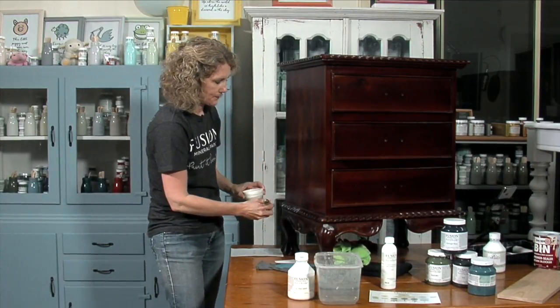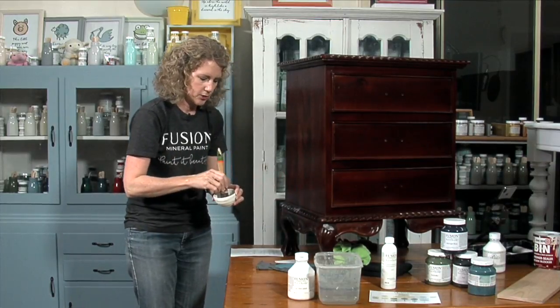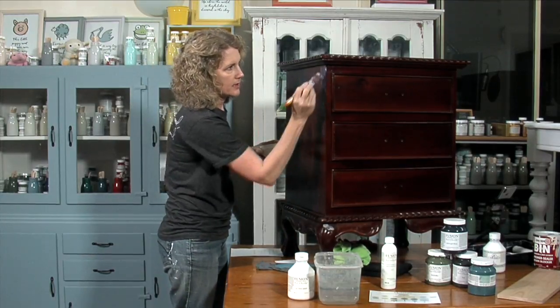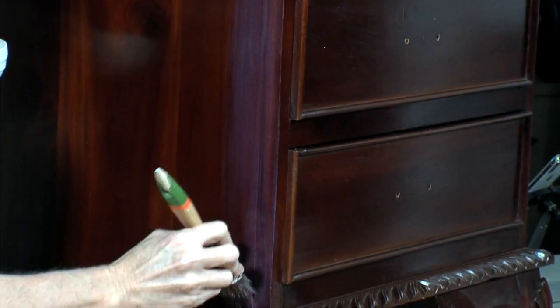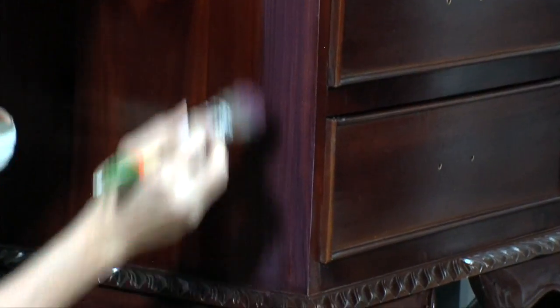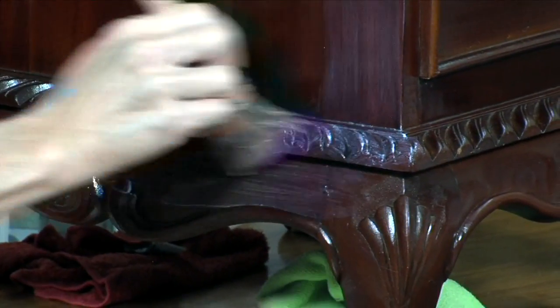I'm going to be using my brush today. You can see I've kind of scratched up this surface — I'm not going to bother sanding it because we've got UltraGrip happening. I just wanted to show you how thin you need to apply it. It looks like I've gotten a bit too thick there — it will dry absolutely clear. You do have to be careful; that's why people use a roller — you don't want brush strokes showing because they may show through on your painted surface. I should have picked a bigger brush! But you can see how thin it is — it's barely there. The brush is great for getting into all these nooks and crannies.